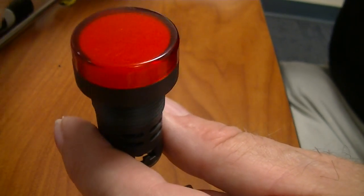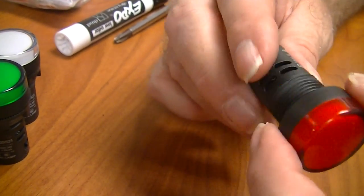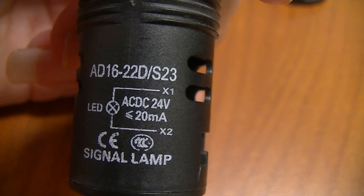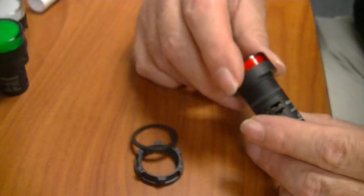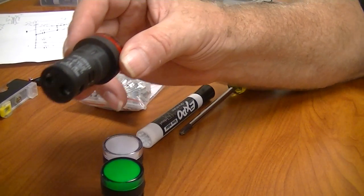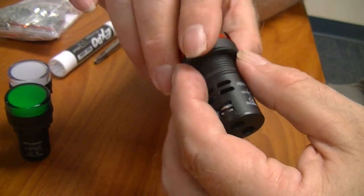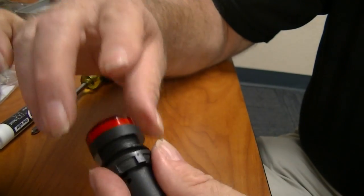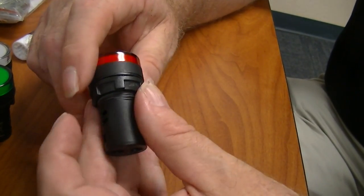This is a typical multicolored pilot light — it's an LED, a light emitting diode. It says AC/DC 24 volts, which is what I want because I have a 24-volt control transformer. It's the same diameter as the push button and the selector switch — same hole. Put it in the hole, gasket on the outside, lock surface on the inside, tighten it down and it's good to go.